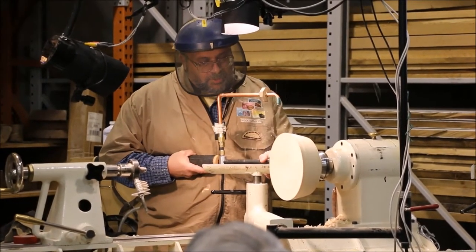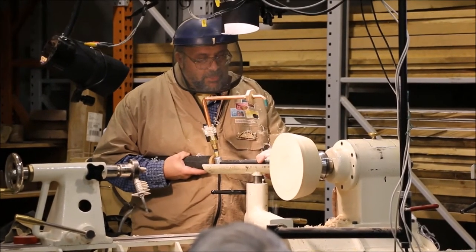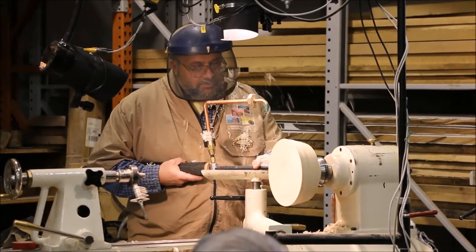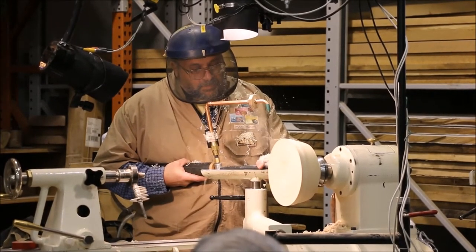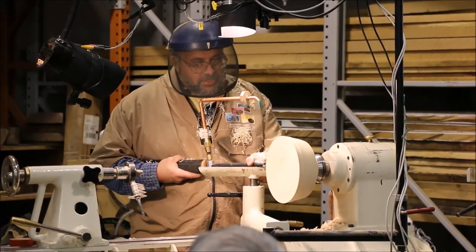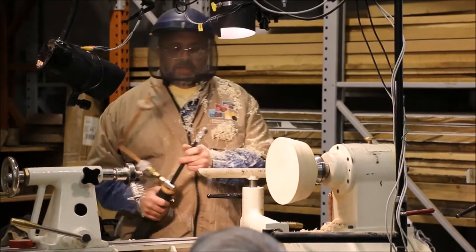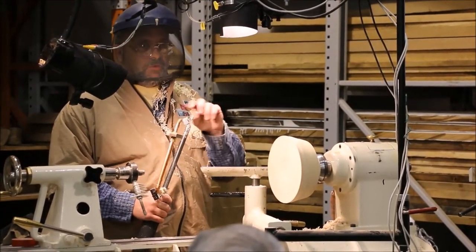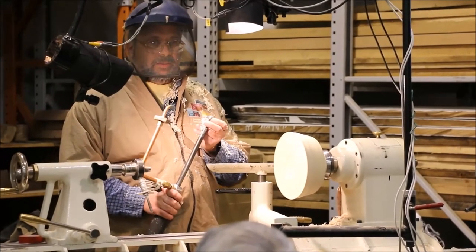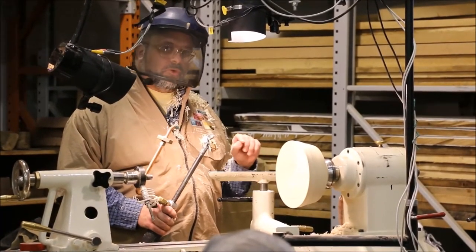You can see I put it in. Like I said before, you're going to come in here like this, and I can ride here on the upper one without it cutting. If I bring it up a little bit, it'll cut a little bit more. Right now it's cutting better in the left-to-right motion than right-to-left. That has a lot to do with the way I have it set. The depth gauge or guard moves around a little bit — I have it set so it's pretty open on the left-hand side, which is why it's cutting more when I go left.